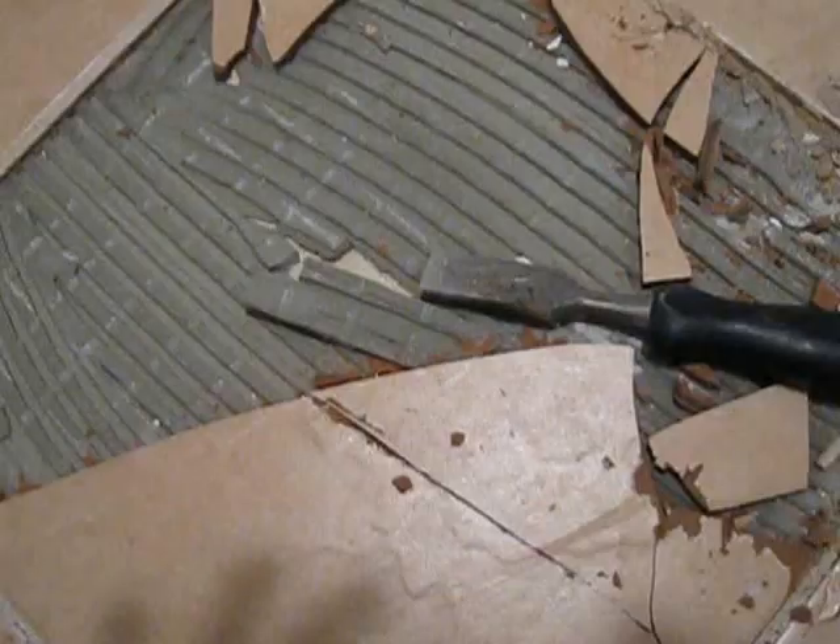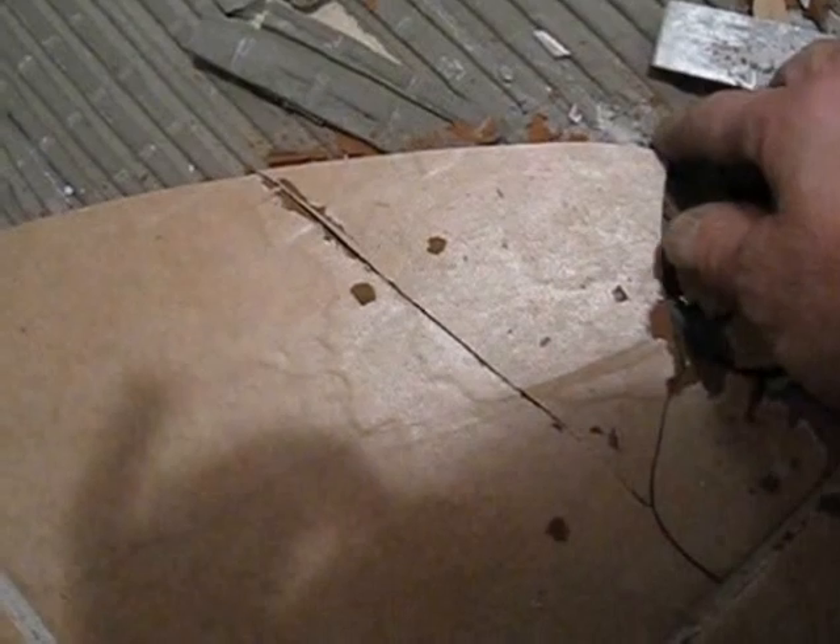In this close-up shot, you can see where I struck the tile several times. The tile is actually popping loose at its very corner where the grout is seriously eroded and missing. Once you get into tile removal and start getting chips out, you'll eventually reach a point where you can drive a larger run on the chisel and pull the tile up in a larger section.